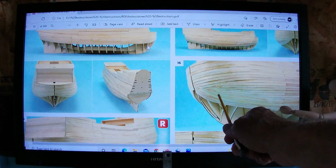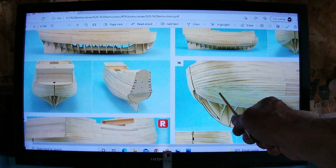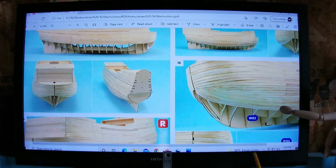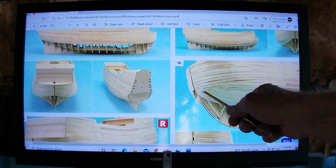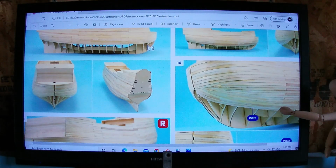So what I've done was bring the first 6 down onto this rib that's second from the keel line. And then I put one in there that's just tacked in place to use as a placeholder until I get the rest of it filled in below those 6. So there's actually 12 altogether before you get to the place where a full board is used again toward the front.